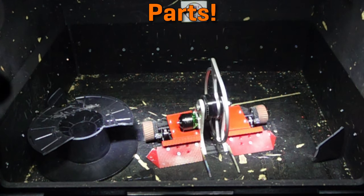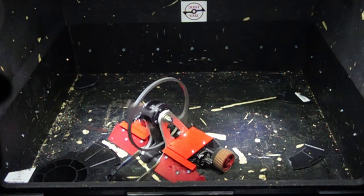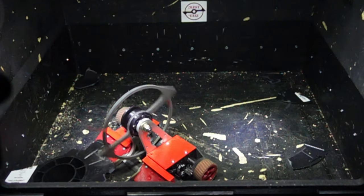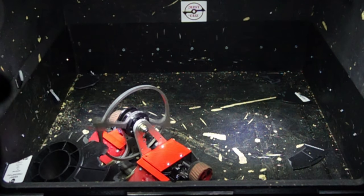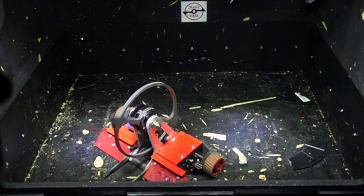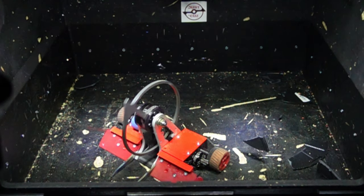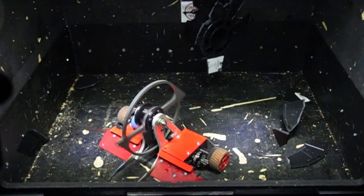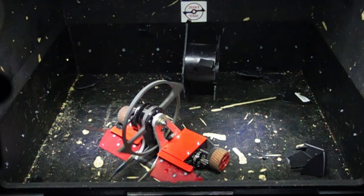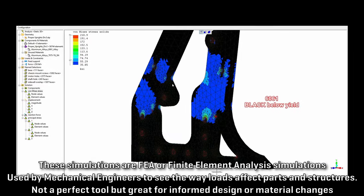A lot of the parts you see on the robot were laser-cut by SendCutSend. The forks in the front are 1/8-inch thick titanium. The blade is AR-500, like I said. The uprights are 1/4-inch thick 7075 aerospace-grade aluminum, which is about 80% stronger than the 6061 aluminum I used last time. However, I've heard anecdotally that 7075 is a little more brittle — unlike 6061 which tends to bend, 7075 tends to crack. Since I did have 6061 uprights bend on Division version 2, I decided to get some backup 6061 uprights in case the 7075 ones fail, so I have enough uprights to build six Divisions currently.